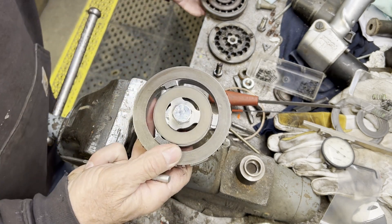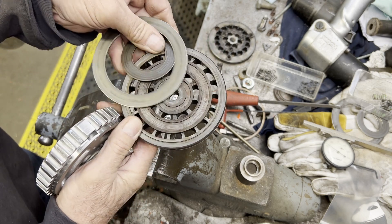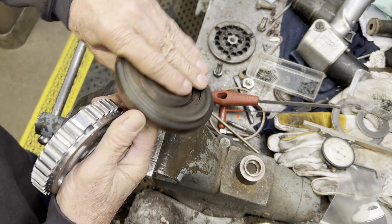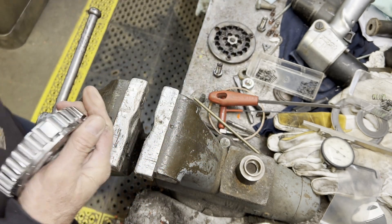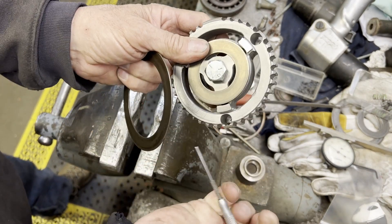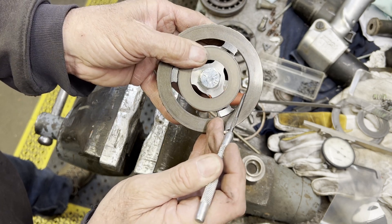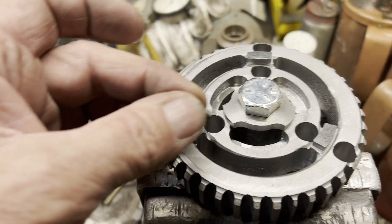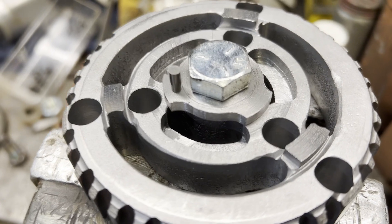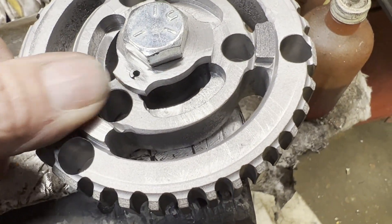If I did not machine the areas on the inside guide ring, whenever the inside valve plate or valve ring would open, the air would only go to one side of the valve ring. Here are the ports where the air flows through — the valve ring basically covers those ports, and then pressure or vacuum just pushes the plate right off the seat. Once the ring is off the seat, it can flow on both sides of the valve rings. I machined that inner guide ring so when the whole valve is bolted together, it sandwiches the guide ring between both halves. I decided to go ahead and pin it for a little extra safety, then ground it flush so when it's bolted together it can't go anywhere.